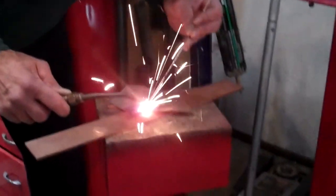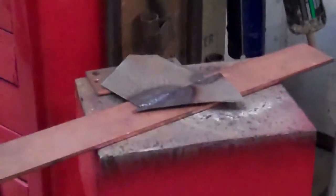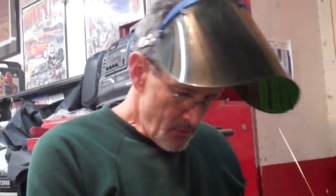You don't want to go more than an inch, depending on your situation — even less than that if you've got an area subject to warping. Often times half an inch, hammer weld it, skip ahead. If you're doing a longer panel, start here, weld half an inch, hammer it, move ahead, weld that, move ahead, weld that, and come back — so you're not building up heat in the panel. The rod is mild steel. I've seen people weld with coat hangers — I did that for years, there's nothing wrong with it. It's just mild steel.